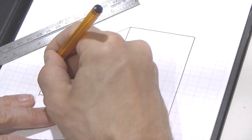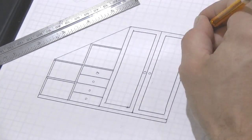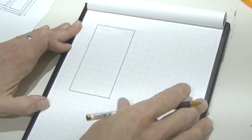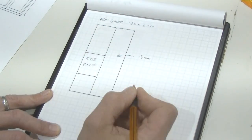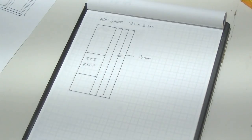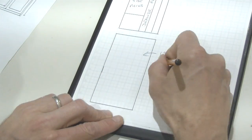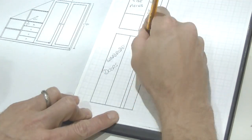Armed with my trusty straight-line pad, I set out the two-dimensional structure of the wardrobe system. Once you've drawn out the flat structure you can start to envisage all the different panels you're going to need. Here I've got the 18mm MDF which I'm drawing out to work out all the side pieces and drawer fronts, and then the 12mm MDF sheets for the actual wardrobe doors themselves.